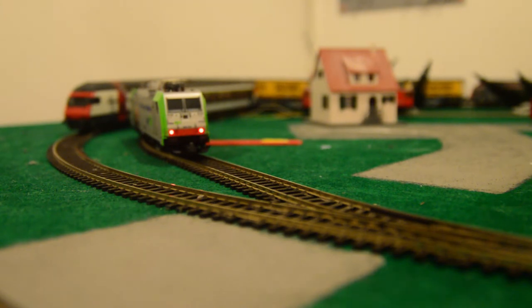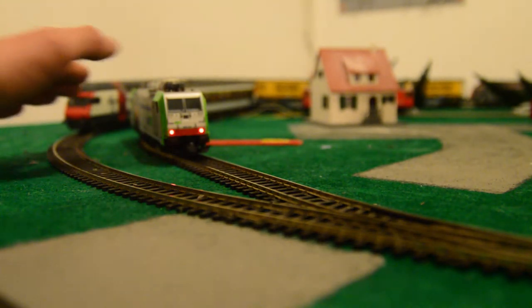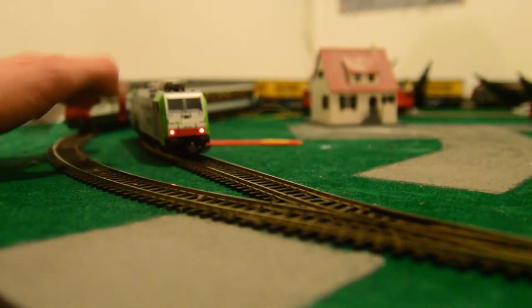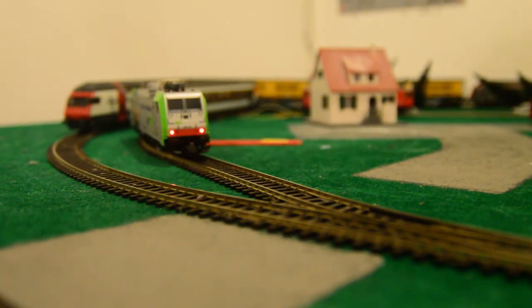Railway baseboard layout, and here you can see we've got the lovely Roco locomotive with the Gaugemaster decoder freshly fitted. In order to get this to work with our setup, we are going to CV program the locomotive so that the Z21 can send the commands to the right locomotive. At the moment the value is 3, but we can change this, and this is really easy to do.